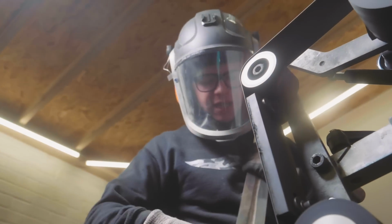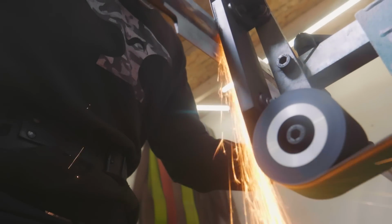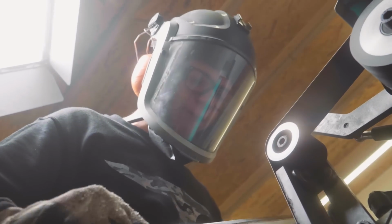This wiggle means that I need to remove material on this side. I'm not following the bevel straight away. Instead, I'm coming in at an aggressive angle. I'm doing my heavy stock removal, and then I flatten it off. That reduces my surface area contact for the stock removal, and in turn makes it easier to flatten off, and helps the process go easier.